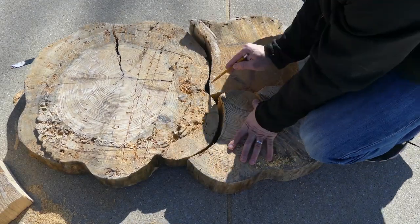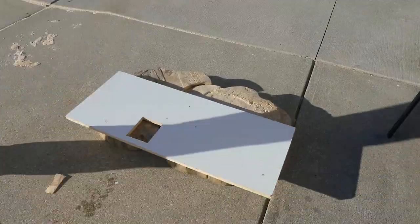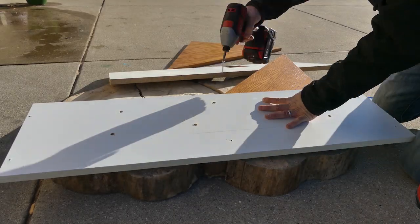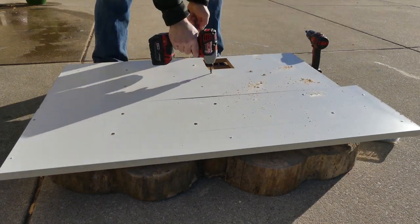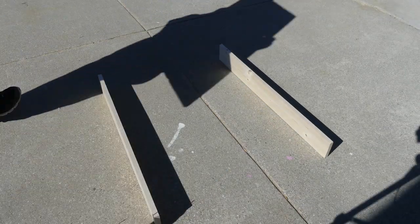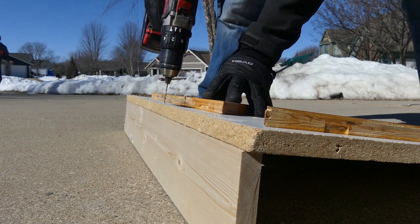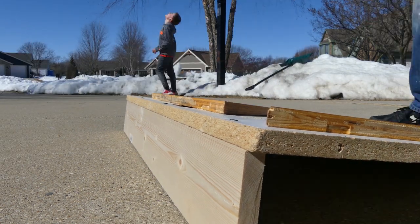So I spent some time trying to match up the curve of this wood. This wood is way too thick and I need to plane it down. I don't have access to a large thickness planer because my neighbor's is only 13 inches wide. Some neighbor. So I'm building a router flattening sled. This will allow me to make the wood an even thickness. I'm using some leftover melamine for shelving and some other scraps. Bonus, it produces a ton of sawdust, or man glitter.